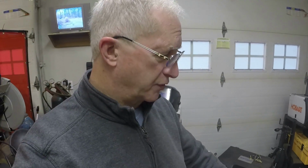Now, the design parameter for this forklift build is 1,000 pounds. Lift 1,000 pounds with these 36-inch forks. So it's 1,000 pounds centered in the middle of the fork, 18 inches out from the back of the fork. And that puts it almost 30 inches from the rear axle, I think was my calculation. If you go back to one of the first episodes, I do a balance calculation and determine how much counterweight we'll need to add. We will need to add several hundred pounds, 300 or 400 pounds of counterweight to the front of the tractor by the time we get done.